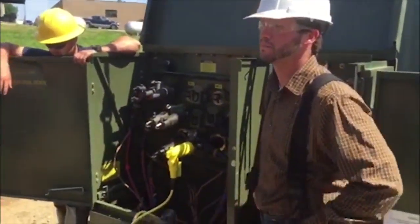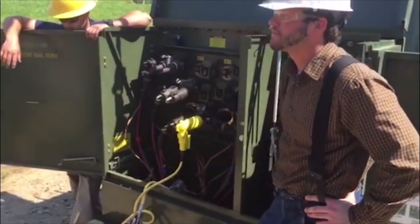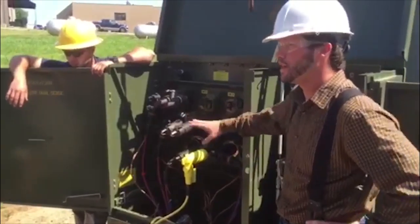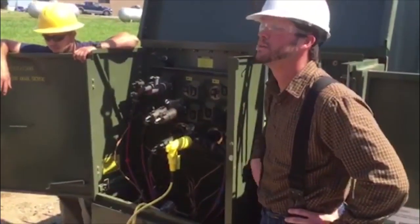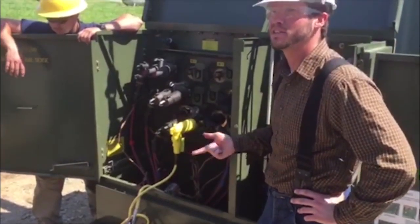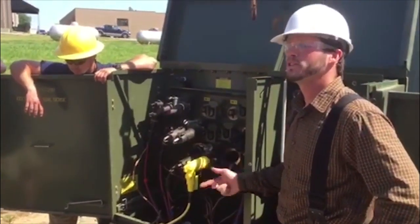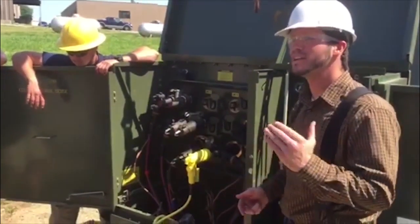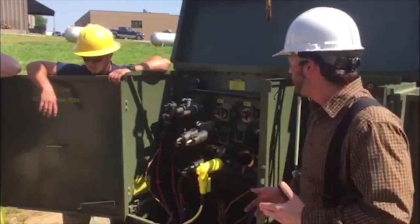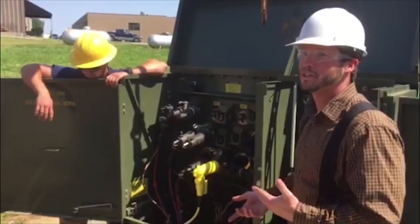Before working on it — if it's not grounded, it's not dead. What does grounding this wire protect us from? Backfeed is one of them — someone accidentally turning that line back on. Another is induced voltage, where a line somewhere else is inducing voltage onto it through the magnetic field.